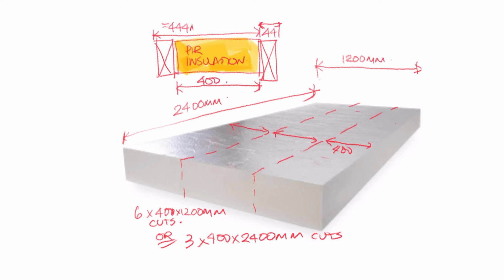The way to centre your joists is to use what we call running dimensions. So calculate the accumulating dimension. I'm using a spreadsheet. You can just do it with a calculator and then write it down on a bit of paper or put it on your phone, print it out, whatever, and then hook the measure at the starting point and go along the whole length with the running dimension and marking centres using the numbers you've noted. That way, even if one of your joists is out, the next joist will be accurate and you will have much less hassle in cutting the insulation.